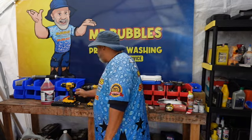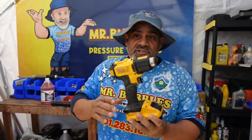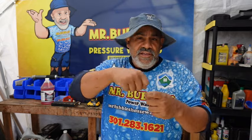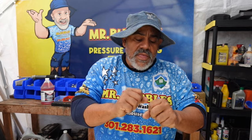The final thing I wanted to show you — one you'd never think you'd need but is probably one of the most important power tools — is a heat gun. What you need a heat gun for is that a lot of the hoses, especially commercial suction hoses you use for your buffer tanks, are super hard — almost like PVC — and they're just not going to fit on the hose barb. So on the last inch, you go around with the heat gun, heat it up real good, the hose gets rubbery, then you stick it in with your clamp while it's still hot. When it hardens again, it molds itself to the shape of the hose barb.